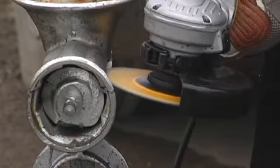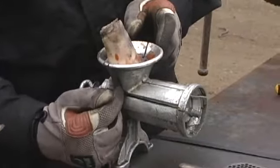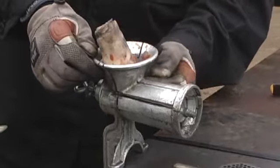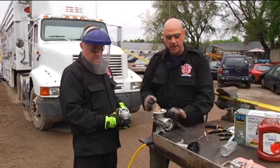All right, so in the essence of saving time, we already made the back cuts on the other side of the machine. So what you've got to remember is this: it's going to be a total of 4 cuts. 1 cut down, 1 cut across, and again on the back end, 1 cut down, 1 cut across. That way we can take the whole upper housing completely off in order to get the hand out.